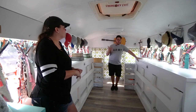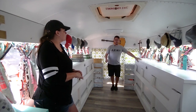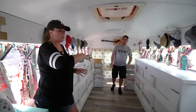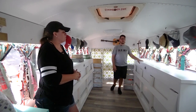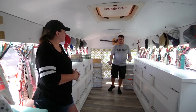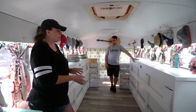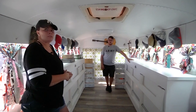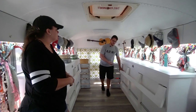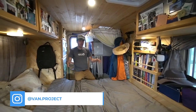If you go to start buying Murphy bed parts, they're really high-end but kind of cheap and flimsy — spring-loaded and size-specific, and none of them fit well. Most of them go up vertically, which wouldn't have worked for me. This one pivots on that bar, which is only half the bed, so technically the weight is almost evenly distributed — it's pretty light to lift. Anybody can lift them; I did it with one hand. Pulling them down is the same way. These are regular residential door hinges. Even though the weight is against the hinge when it sits on the floor, I opted for four hinges instead of two just so nothing would start to sag or move.